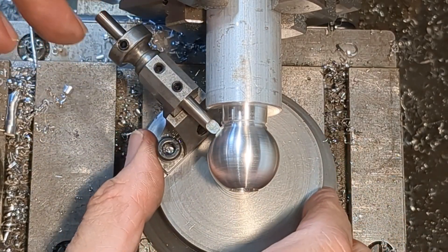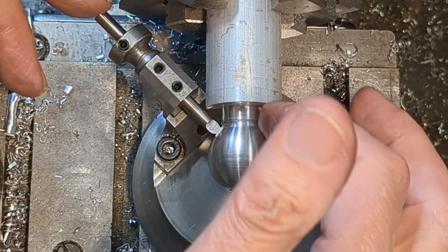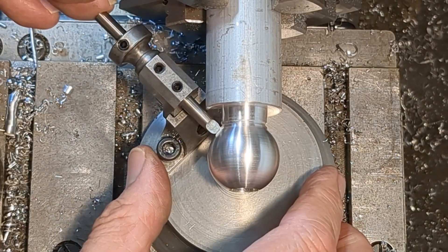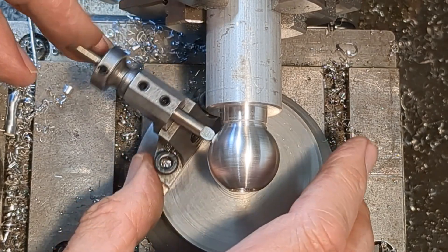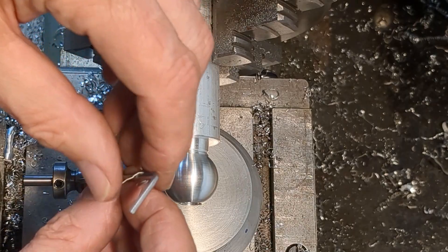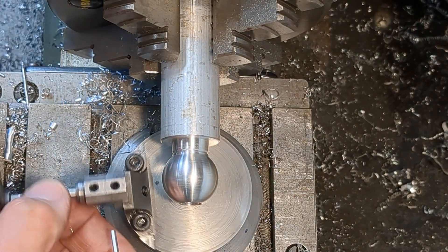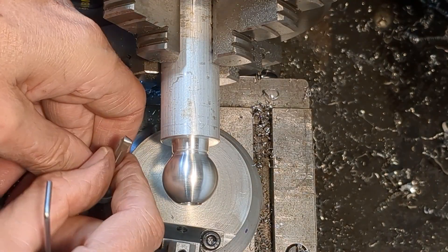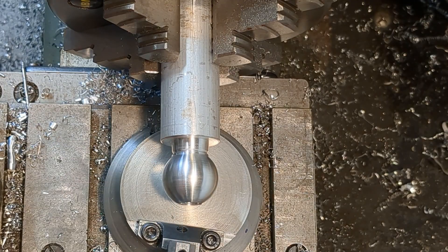This is the kind of issue I'm referring to. Not a problem if you don't have a shoulder — if you just have a plain section you can go around as far as you need to. But when you have a collar like this, access becomes a problem. So what I proposed in the last video was reorientating the cutting tool to be mounted vertically, so it becomes a tangential cutting tool and that way you can get right into the corner.